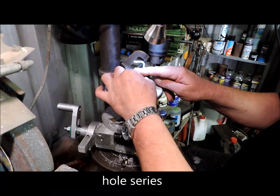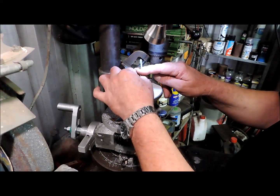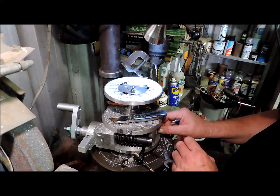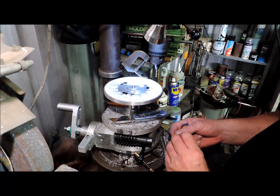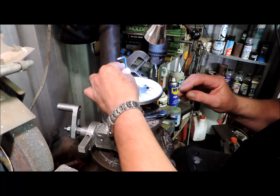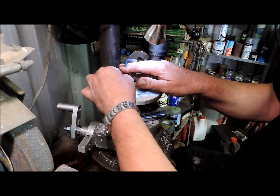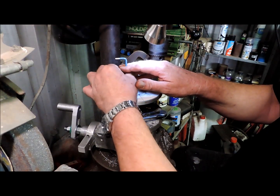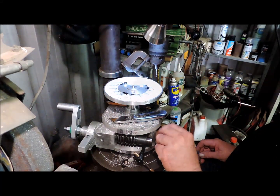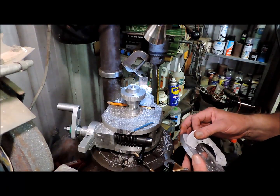Problem being is the alignment with that blade, getting that right. Well, as right as it can be, but remembering there's a 50-to-1 ratio, so whatever incorrectness there is in this plate will be diluted by a factor of 50 at the output end. And with a bit of thinners, this plate cleans off nicely.